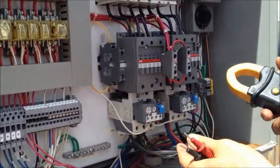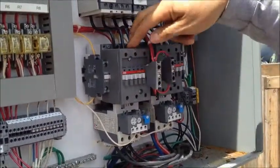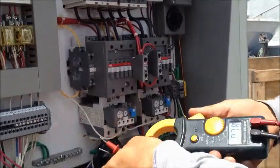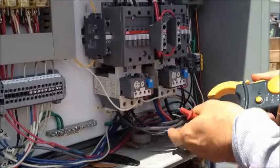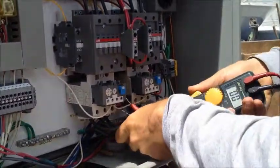The way we would measure amps, for instance on this starter for our SVE blower, is we would put our multimeter on AC amps and put our amp meter around leg one. We would record leg one amps, then put it around leg two, then leg three amps.